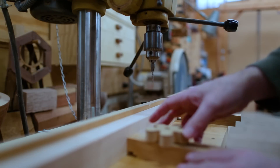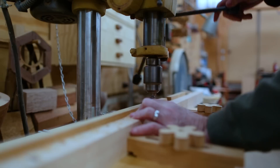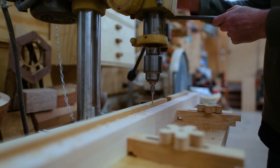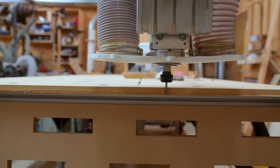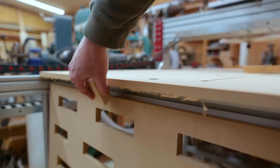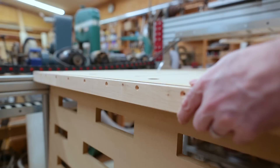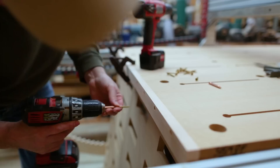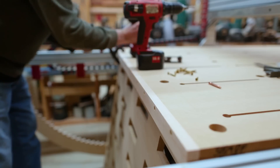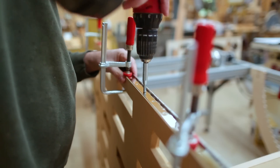I can drill the holes through the piece of maple to go into the spoil board, and I needed to make sure those screws weren't going to be where the screws for the hinge were going to be. Before actually attaching the maple, I wanted to shorten up and square up the end of the spoil board, so I cut off a little bit of the end. This should put the center of the arc of the table's movement in the right place. I should have probably flattened the spoil board after attaching the maple so it would all be flush, but I can do that next time.